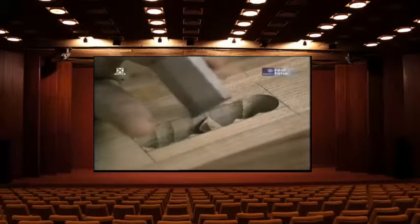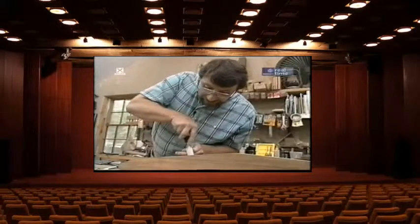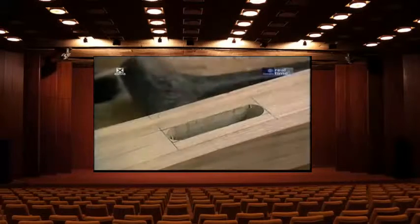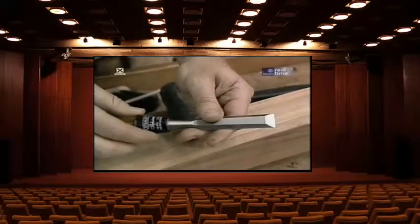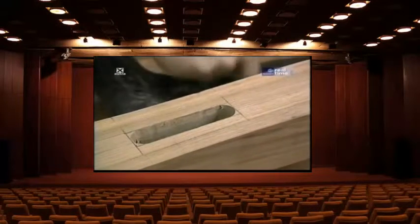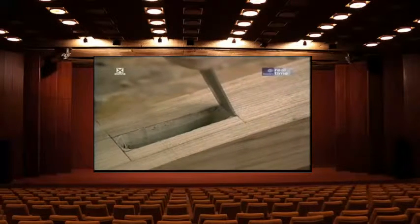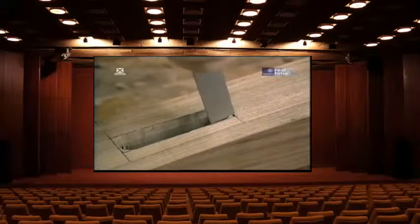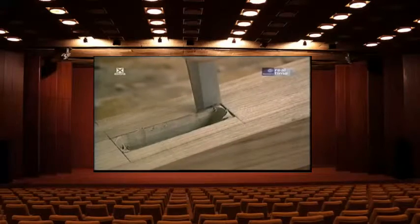You know, this teak, it cuts so beautifully. I can't believe that just with a chisel and hand pressure I can just shave it away. Now I'll switch to my 3/4 inch chisel. I'm using a 3/4 inch chisel because it's exactly the same width as my mortise. And I'll chisel out the remaining corners. Well, that looks pretty good. Only 19 more to go.